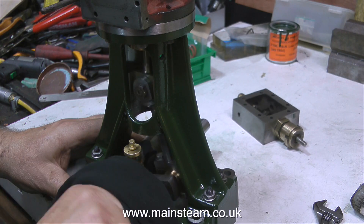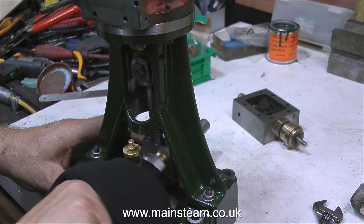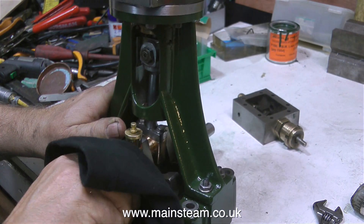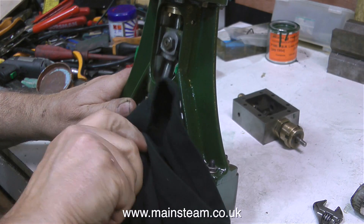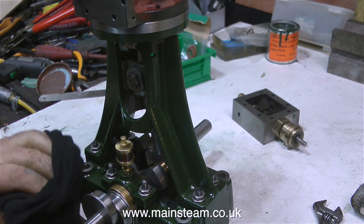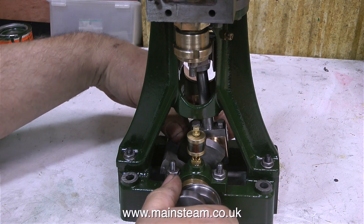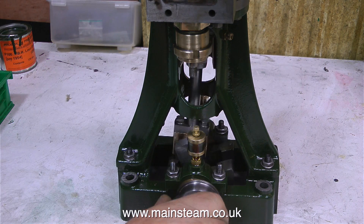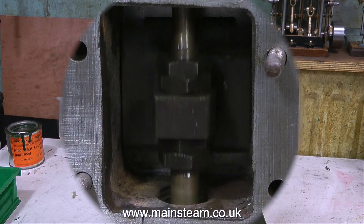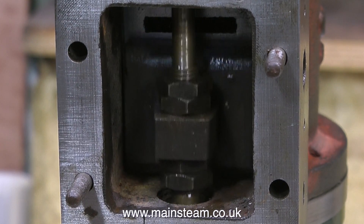It's time now to rotate the engine and see if there are any tight spots. I'm using a cloth because the keyway on the crankshaft is quite sharp. And look at it — it's very free all the way round. No tight spots at all, and for something that's quite large and quite old, and something that was so really hideous when I first bought it, I'm really pleased with this. It's more usual to find that once you've dismantled an engine, worked on it, and put it back together, things are quite tight — but this one isn't at all. The last thing to do on this video is to fit the valve rod and the slide valve. Thanks for watching, and I hope you found it useful.